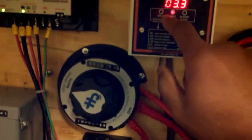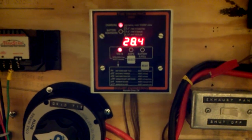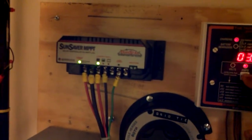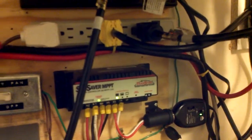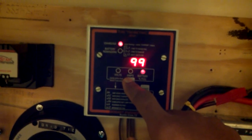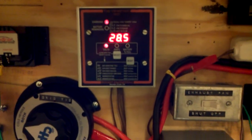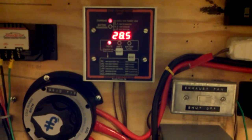Our starting voltage is at 28.4 volts, which basically means the battery bank is full. Right now it's pulling about 3 amps coming in. You can see from my charge controllers there, both of them are going into float mode. It's about 8:40 in the morning. My battery bank is 99% full as far as what the tri-metric is saying, and the voltage starts at 28.5.